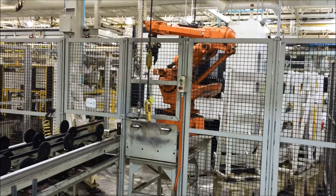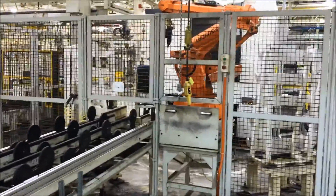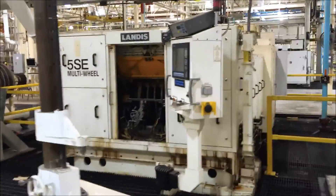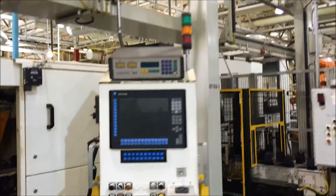It's got 50 tools, high pressure cooling through the spindle, HSK100 high speed spindle. Then you come back into another Fibro system, with Harry Major, into a Landis multi-wheel grinder where we're doing the bearing journals on the flange.